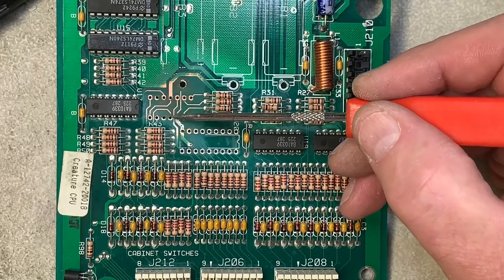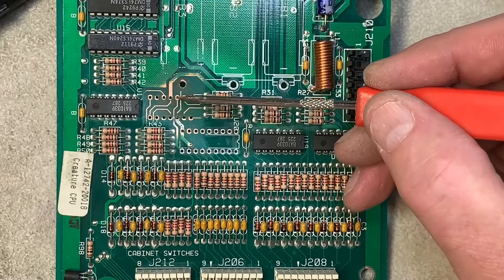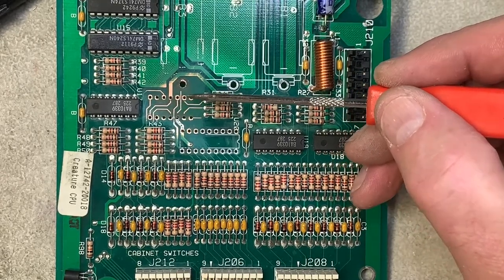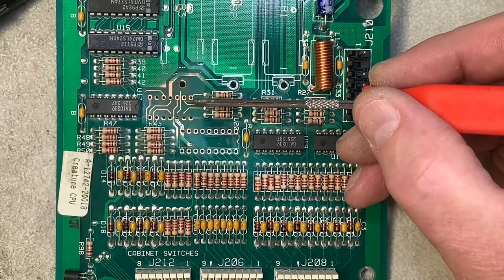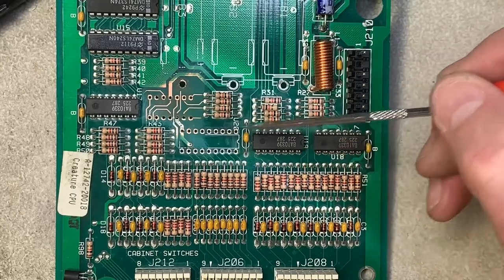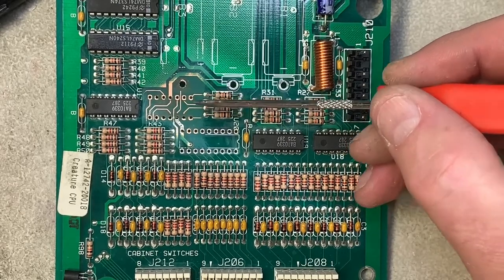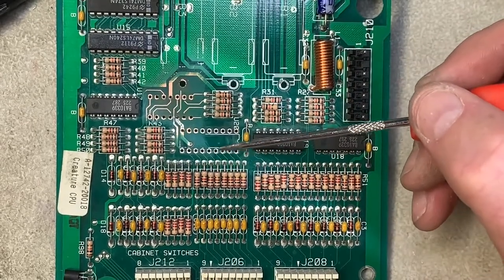This one's got to be rebuilt, and this one here has got a very tiny fracture in it. Alkaline tends to gather up and attack the intersection of a copper trace with the solder pad. So we're going to clean up this just a little bit more, then I'm going to conformal coat it, because I need to do that before I put the chip socket in.